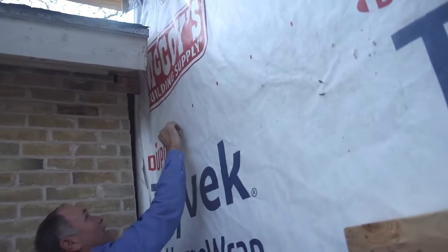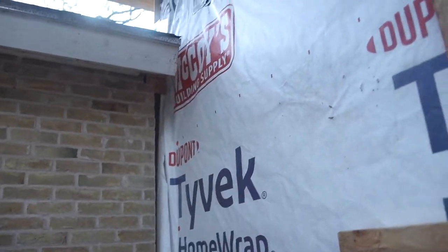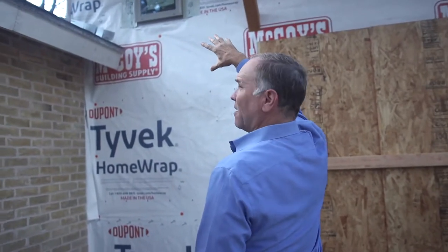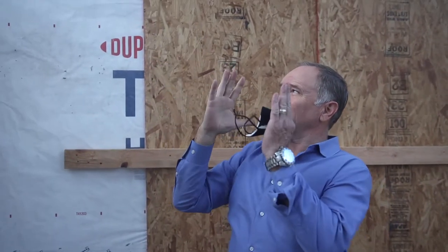This goes straight through with the brick. The step flashing that you're seeing up there is on each shingle. We could definitely get technical on the step flashing — it looks kind of wobbly right now when you look at it because it's not up tight against the brick. Then a counter flashing goes over each one.